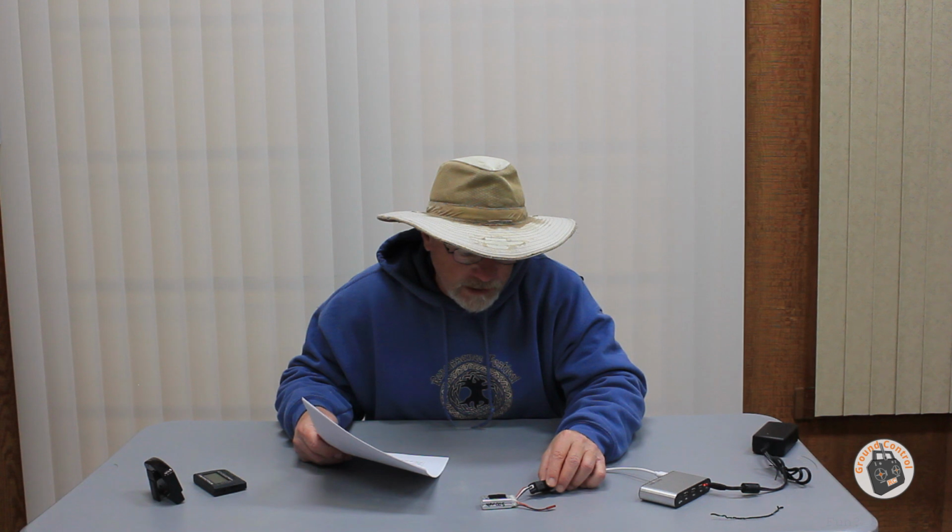Okay, so here's how the ladder works. I want to discuss that a little bit. And I've got, the third light is flashing now, so it's going to take a while before that fully charges. It says when you plug it in, all green LEDs will flash once, meaning that the charger is calibrated after it's powered on. When the charger is powered on, no battery is connected, you'll have a little red LED up here on the top. And I saw that before I plugged the battery in. If the charger detects an abnormality, there will be a red light flashing on the charger. So it could be that there's a bad connection with the battery or something. So it says to reconnect the battery and troubleshoot the cabling or whatever. But if you see a red flashing light, you know there's something wrong somewhere.